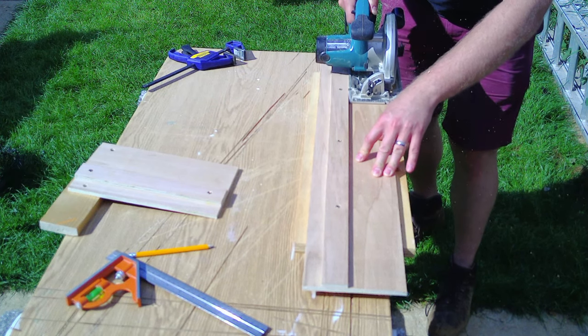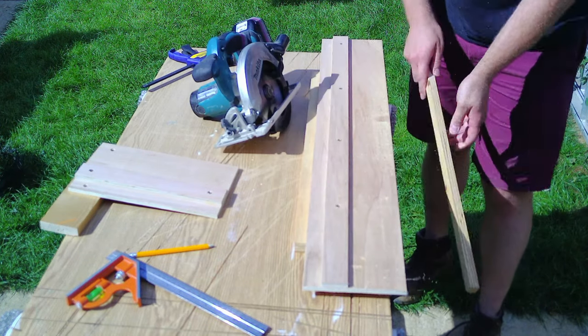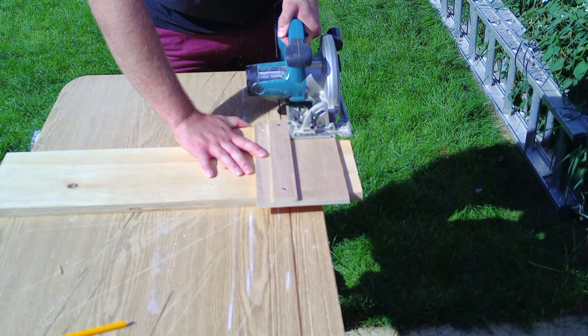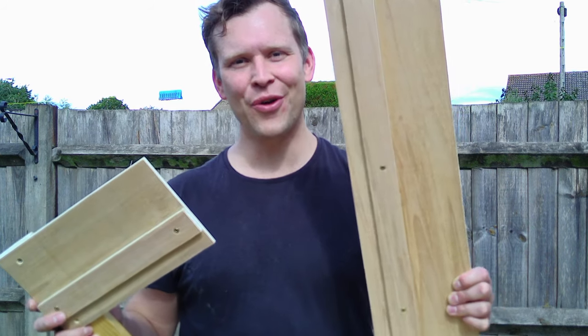Now it's time to see whether the different sledges work. As you can see, I'm just taking a slim cut off a piece of plywood, and it leaves me with a beautiful straight edge. And the same thing for the cross cut sledge — it makes the cross cut at 90 degrees simple and easy to do. So there we have it: two jigs, one for a rip cut and one for a cross cut with your circular saw. It'd be really interesting to know if you have any alterations or improvements — please leave a comment below. If you've enjoyed this video, click the subscribe button, hit the like button, and leave me a comment. Take care, enjoy your woodworking and DIYing, and God bless. Thanks!